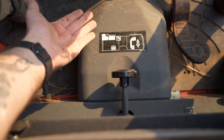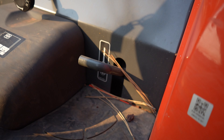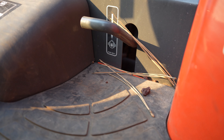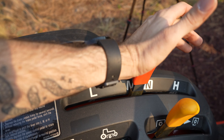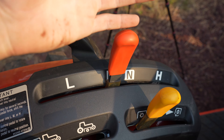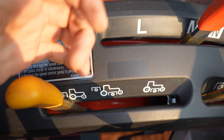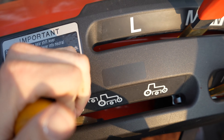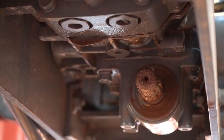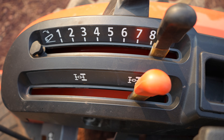Down here is your adjustment for your three-point hitch — how slowly or quickly it goes down when you release it, since there's only hydraulics moving it up and then it flows against those hydraulics going down. Over on the other side you have a diff lock, so I can lock the differentials together on the back wheels. On the left side you have your high, medium, low, and neutral range selector — that's super handy. You have a PTO engage, and this actually has a rear PTO and a mid PTO, so I can run just the rear, the rear and mid, or only the mid.